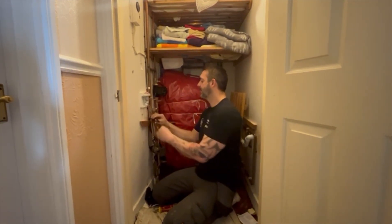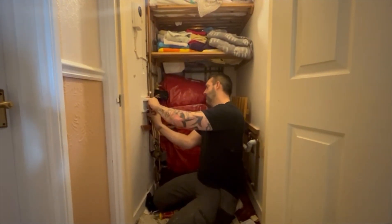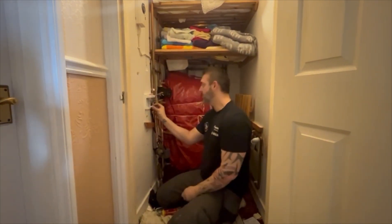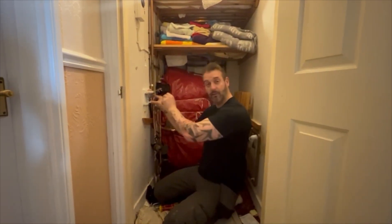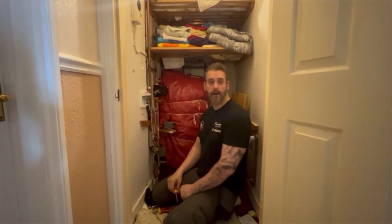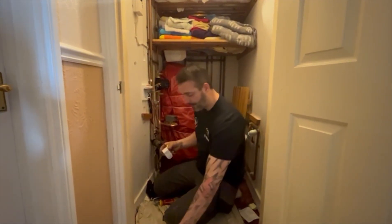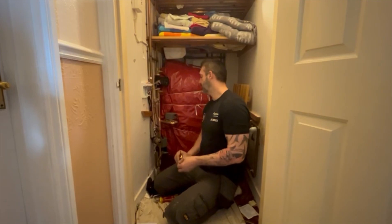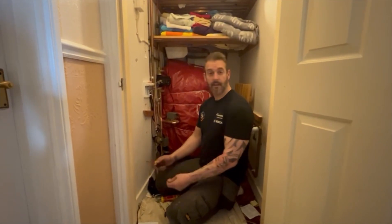Just do the wiring here - cut these little cables back so it's nice and neat, put them in there so no cables are exposed or anything. Just carry on doing your wiring, get it all nice and neat, cables all tight - don't want them all flopping all over the place. Get it all nice and tight in your wiring centre - all your lives, all your neutrals, all your switch lives. That cylinder thermostat is going to tap down to the cylinder - put a strap around the cylinder nicely. Wire it all up correctly, get all your new components in.